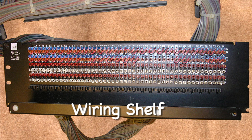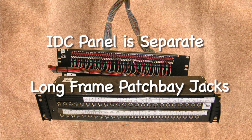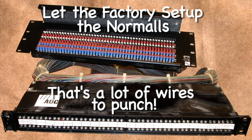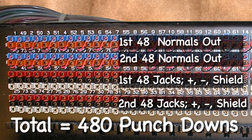The IDC panel on a patch bay usually comes with a tie bar or shelf that gives you a place to support the wiring, preventing the attached wires from being pulled down. You can also get them with the IDC panel detached on a separate mountable panel with cables connecting the patch bay to the IDC panel. When ordering, the normals can be configured at the factory, or you can have the normals brought out where you can configure them by wiring the IDCs — this is also called normals out. This provides a great deal of flexibility, but takes longer to install. Unless you have a unique situation, you should order your patch bays pre-wired at the factory for the normals you want. Some patch bay manufacturers now offer normaling switches on the back and even on the front of the patch bay, making it easier to make changes at a price.